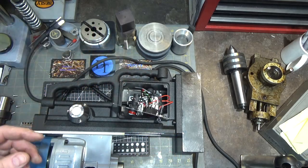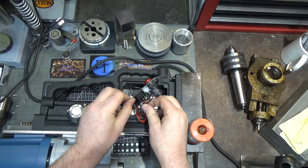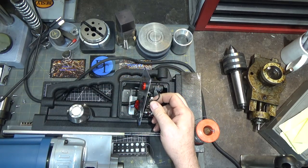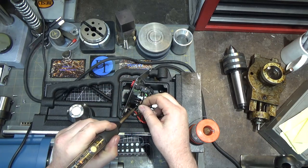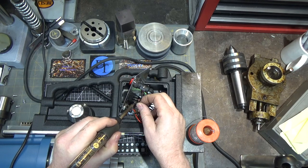Not that it's any surprise, but there is no heat shrink inside here like you would normally expect to find. With the all-metal case they at least do ground the whole outside, so if one of these wires were to touch the metal case, they would just trip the breaker or blow this fuse right here. I think what this could really use would be a complete rewiring.